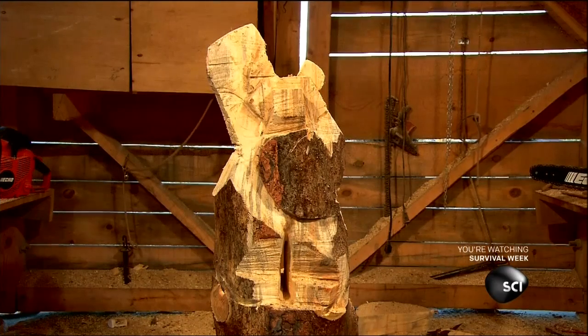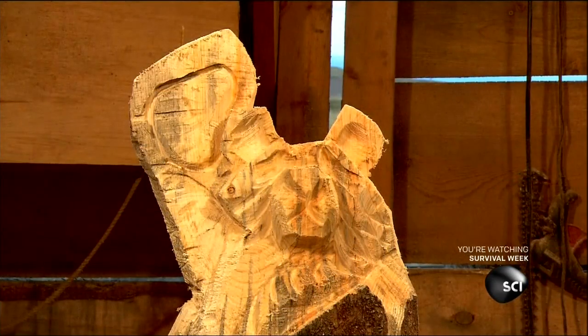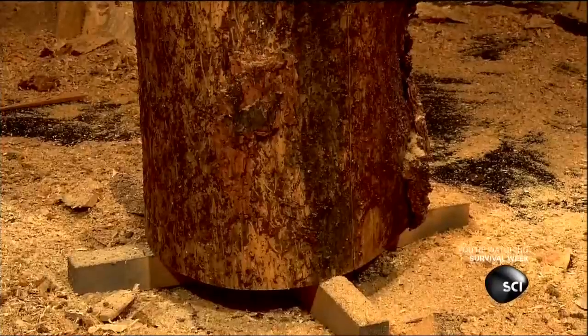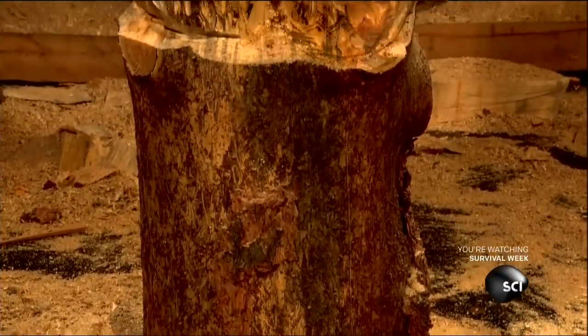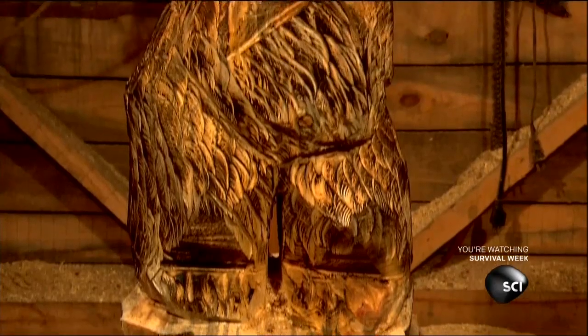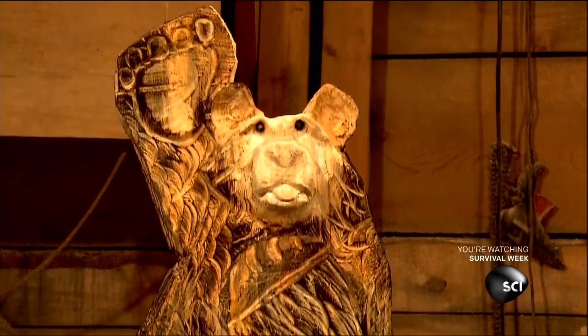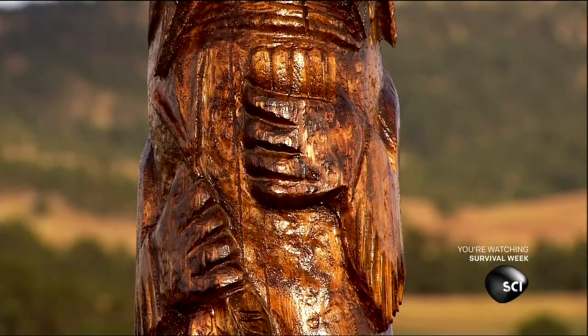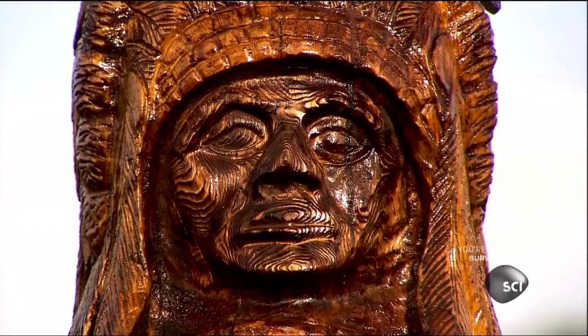It forms a suit of armor against precipitation and the sun's ultraviolet rays. Yet the sealant isn't an airtight shield. It still lets the wood breathe, which is critical for preventing mold growth. It's also flexible, moving with the natural expansion and contraction of the wood. An inflexible sealant would crack, letting water seep in.